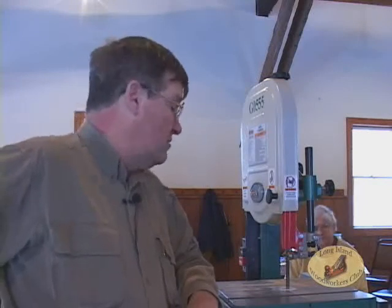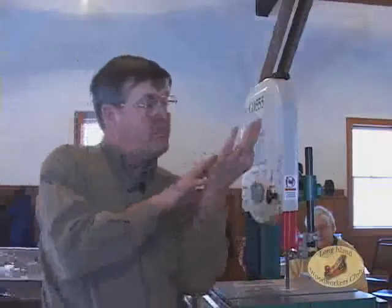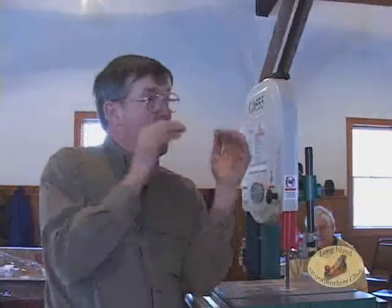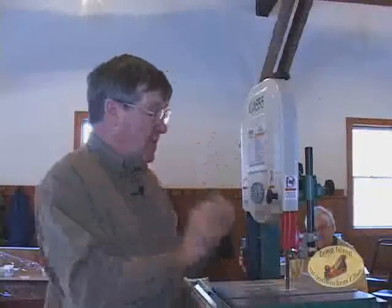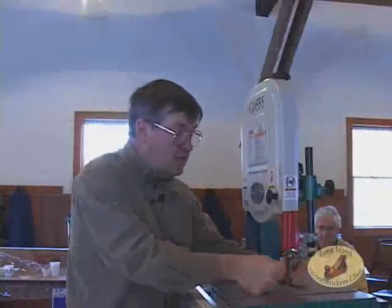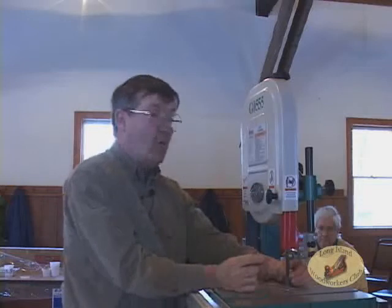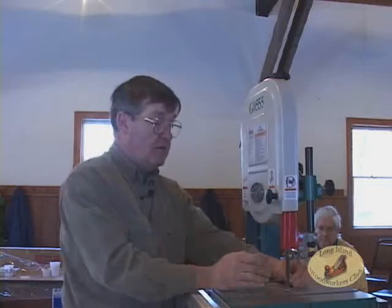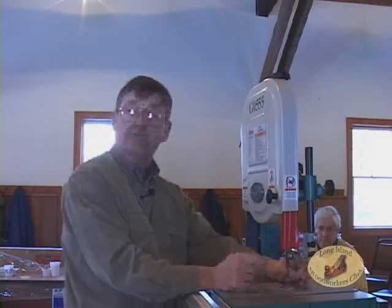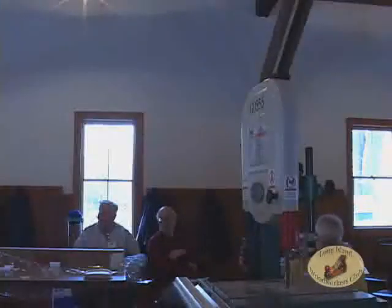It is possible to sharpen a bandsaw blade. We did one at Bob's shop — I take a Dremel with a small abrasive wheel, dress it flat on the front with the dresser, and then just peck away, face-dressing the edge of each gullet as square as I can to the machine, going tooth by tooth. When you see ground teeth coming through, it takes about 20 minutes. On a 1/16-inch blade I only use the back guide and back the others right out of the way.